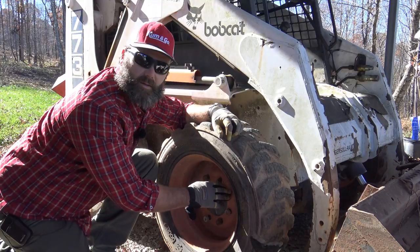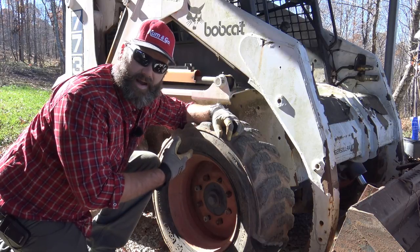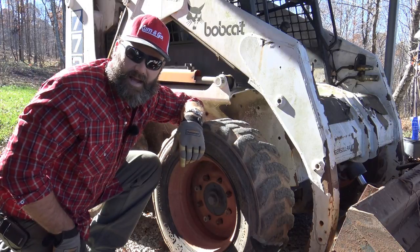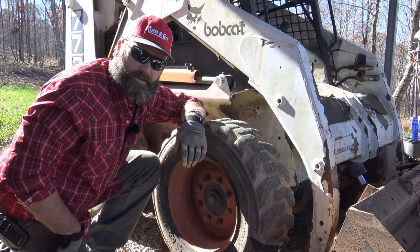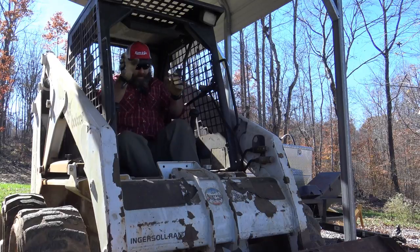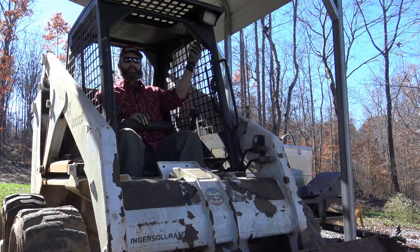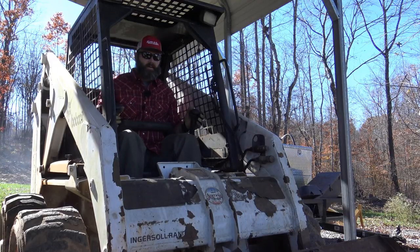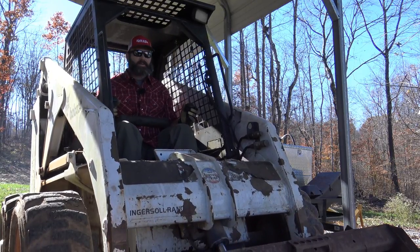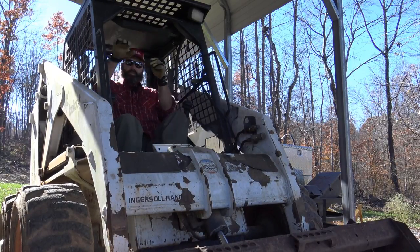What I've done here is I've loosened all but two or three of these lug nuts right here, so that I can raise the skid loader up. The skid loader comes with its own built-in jack. I'm not going to use a floor jack — I'm just going to take the skid loader bucket and lift up on it, and put some jack stands under the axles, pull the wheels off, and leave it sitting. We'll take the wheels and tires over to the tire place. Let's get on the loader and raise it up a little bit here. We just need to raise it up enough to get it up off the ground. That's it, we'll shut it down. Pretty simple.